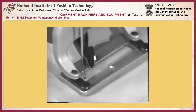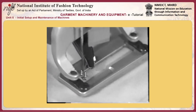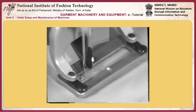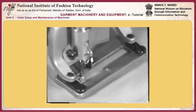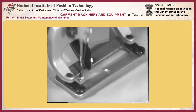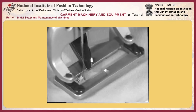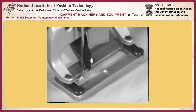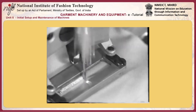Pressure of spring of the needle thread trimmer. Check to be sure that the needle thread trimmer clamps the needle thread with a consistent pressure both at portions A and B. The needle thread clamping force is approximately 120 grams. If the needle thread trimmer loses its clamping force, slightly bend portion C of the spring to adjust so that the spring comes in close contact with blade D over the length to allow the needle thread trimmer to clamp the needle thread regardless of the position of the blade that cuts the thread.